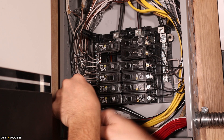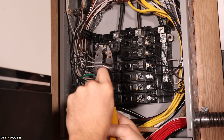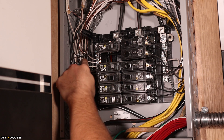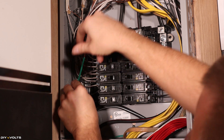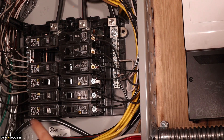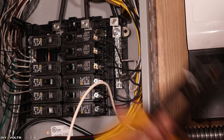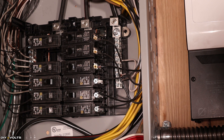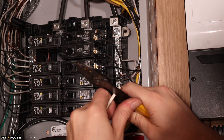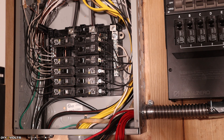I've got my green wire — I'll give myself plenty of extra and cut it about here. I can now strip that down to expose the wire. I've got an available spot on my grounding bus bar and I'm going to take this wire and sneak it up under the others. Likewise to the green wire, I'm going to take the white wire and connect it over to my neutral bus bar — about here should give me sufficient wire. Once again, strip down the end. Now that the neutral and ground are connected through the transfer switch, it's time to work with the breakers.